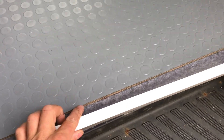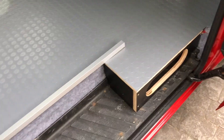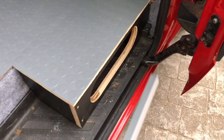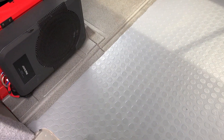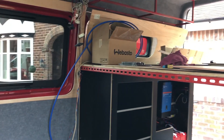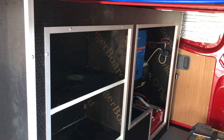Round here where you can see the edges, we put an aluminium angle on the end — obviously cut it, mark it around the corners. Should neaten it all up. Looking good, done a nice cut against the mat there. Starting to come together, get these boards covered soon. Floor's down, all the aluminium trim's been done. We used a really fine blade on the mitre saw to cut that; it's been fixed in place — all the edges done.